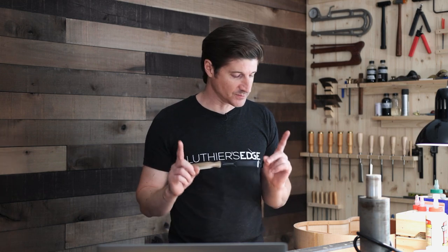So that's one reason why I always want to seal the inside of the guitar. When it comes to arch tops, it's really, really important because the arch top expresses humidity gains or losses by the top either rising or lowering in a surprisingly drastic amount - which is why most bridges have thumb wheels. On a hot humid day, if somebody's guitar was used to drier conditions and suddenly the humidity is 20% higher, that bridge could rise up an eighth of an inch or more and the strings will be way off the fingerboard. Sealing the inside slows down and evens out that reaction, protecting the wood over time.